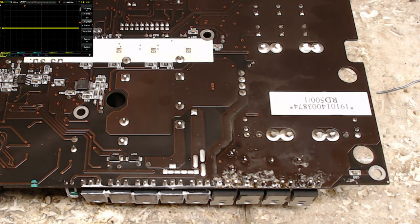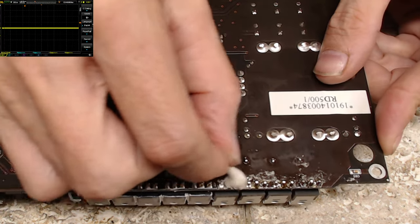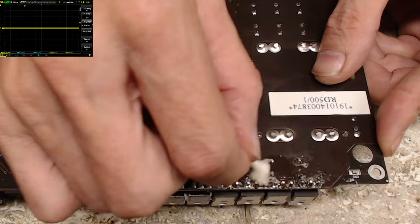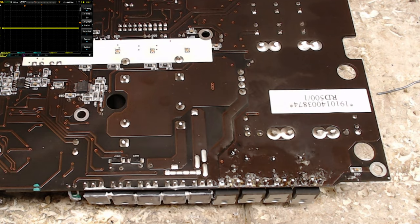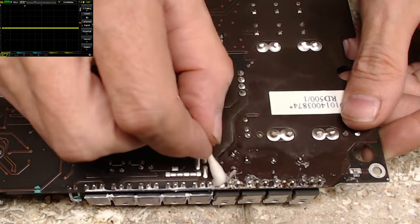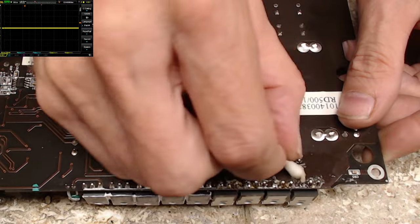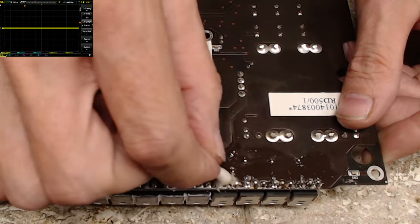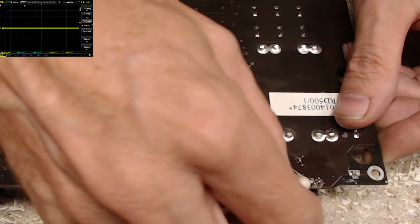So this is the repair of this JL amplifier. With these transistors in, it will attempt to build rail voltage. And since I had already went through and verified that I didn't have any shorts in the output, I have no doubt in my mind that this will start up and continue to function for the owner as intended.